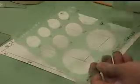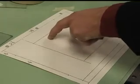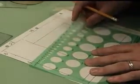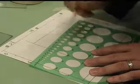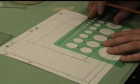So just like on the last drawing, we're going to fillet these corners, and then we're going to make a half a circle, a little hat up here on this one. So the 1 1/4, I'm going to touch it off on each one of those edges, and I'm going to round it over a little bit.